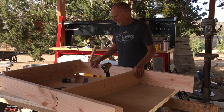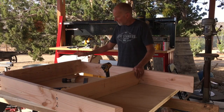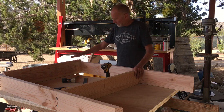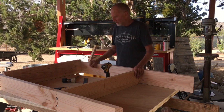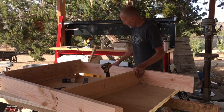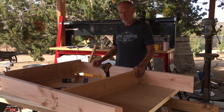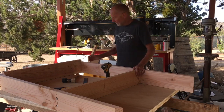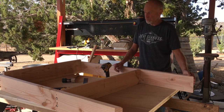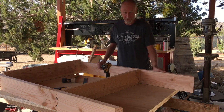I made a box. These boards started their lives as 2x8s. This board remains a 2x8, but these other boards I ripped on the table saw down to six inches wide. The length of this board is about 57 inches, but really anywhere from 55 to 60 inches is fine.